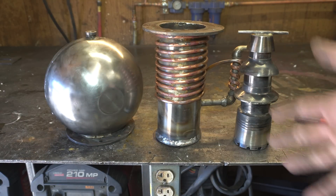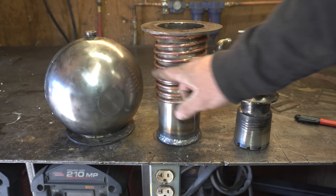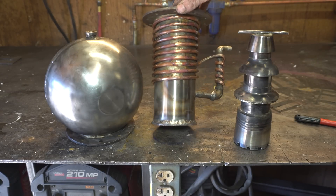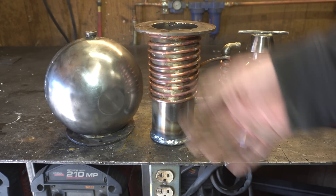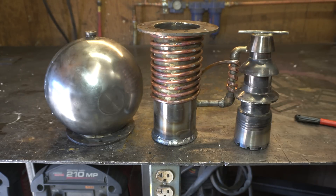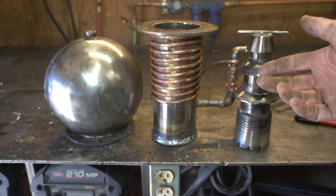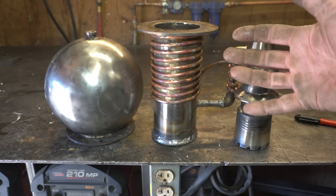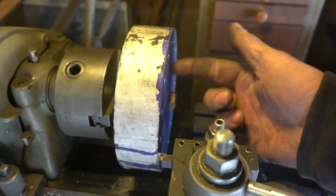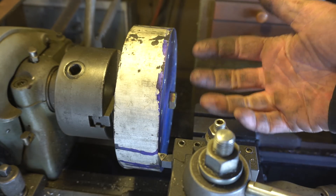So I got all of these reasonably cleaned up. I kind of wish I had enough solder to solder this all the way around — one, for better heat transfer, and two, I think it looked cleaner than these little tacks, but whatever. The last thing we've got to do before testing this is to make a baffle. And rather than the little cheaty baffle I made last time, I'm going to make this thing proper out of aluminum, as it's much easier to machine. And as some of you have suggested, I'll be making it water-cooled. The only chunk of aluminum I have that's big enough is way too big, so I'm going to have to machine nearly an inch off of this thing.